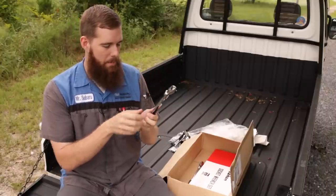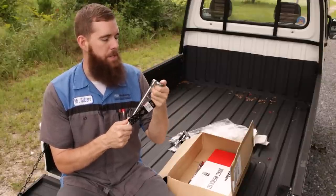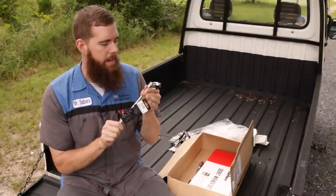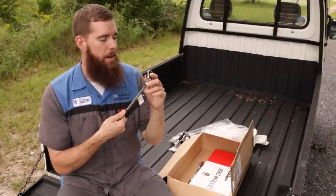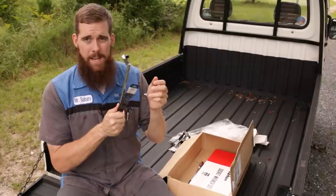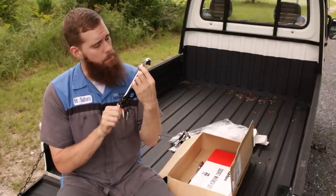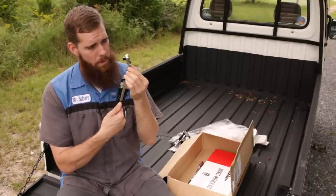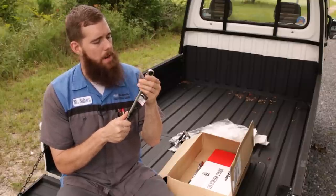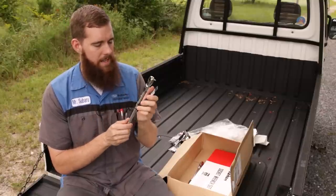There's just no locking in here, no button or trigger to lock it. It's just a really strong detent, so when the joint wears, it's not going to get all floppy unless the spring goes out. But since this is riveted together and not a screw or bolt like most modern tool truck flex-head ratchets, this is probably non-serviceable and would have to be warrantied out. I'm not sure what Tone's warranty is on their hand tools.